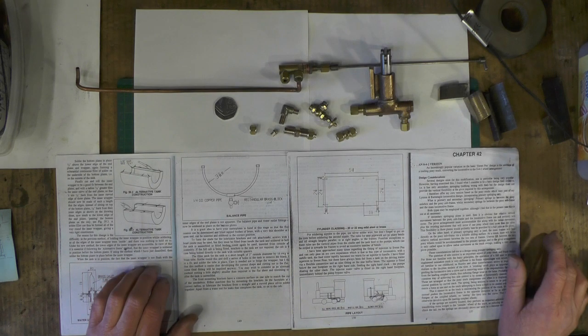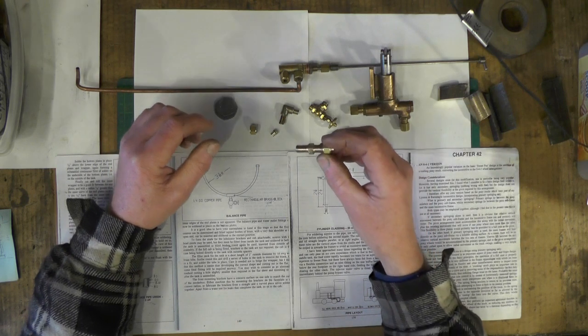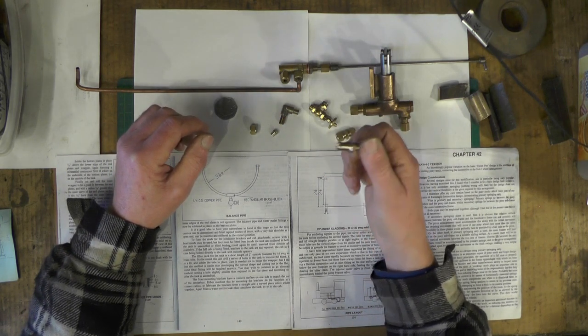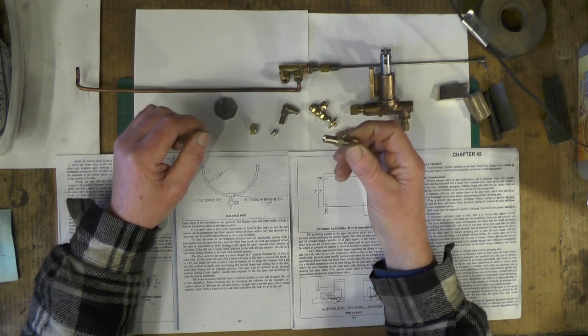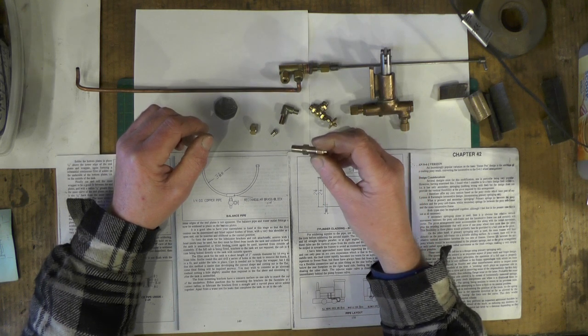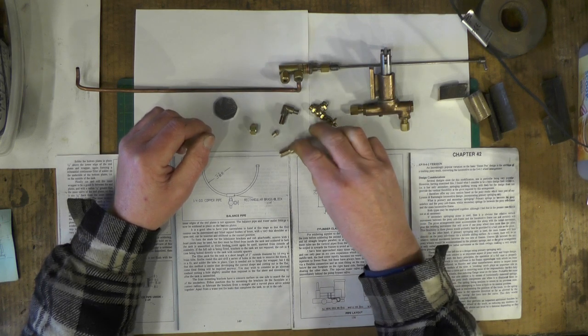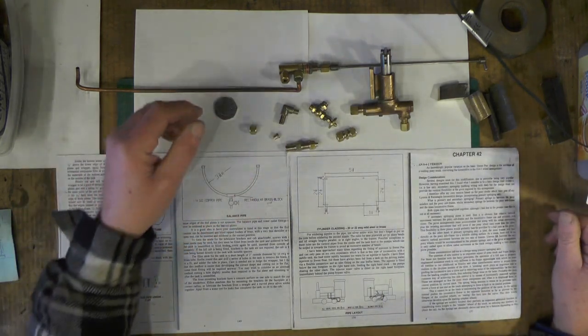I don't know if it matters if you deviate from those sizes, but I'll stick to the drawing anyway. The main one is going to be 3/16" pipe. Over at the lathe I'm just starting to make some unions, nuts, and olives. Now I know what you're saying — why don't I go out and buy them? Well, two reasons: I like to make everything if I can, and while I'm waiting for postage in this climate — 7 to 10 days — I can be on the lathe and have them made.